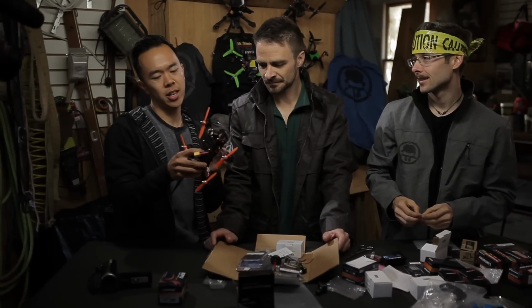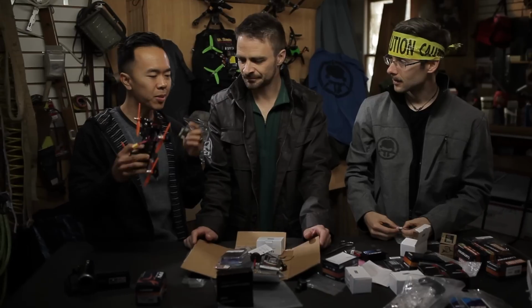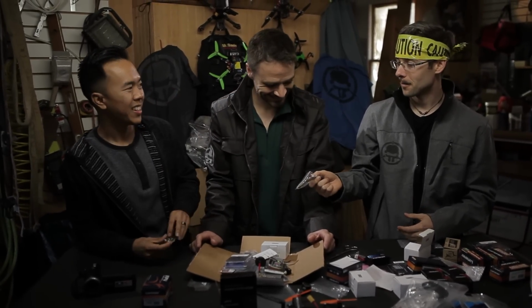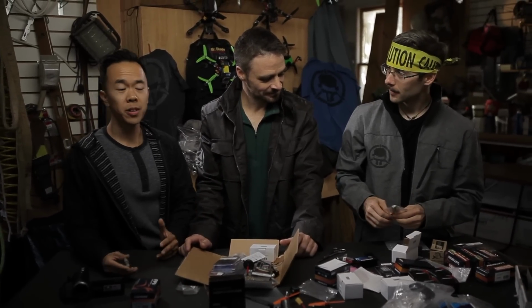Right, because just to say, this one is a Naze32 running an F1 chip. You disable the accelerometer, you'll get the same performance. I will say that if you disable the accelerometer, you can go down to 1,000 on the F3 and you can't on the Naze. You can only go to 1,200 on loop time. Oh yeah, if you're running Cleanflight. Or we can run Betaflight and drop it down to 1 kilohertz. We will probably be running 1.9.